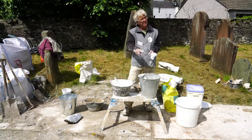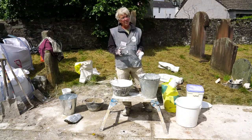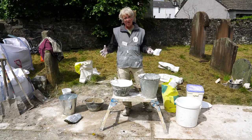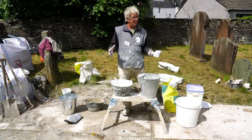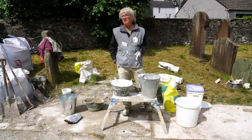It was only in a few places that it had failed. So lime wash is much more durable than people say. And if you think about a 15 or 20 year cycle, that's actually a longer cycle than most modern paints would achieve on that same building. And it will be doing your building good in the meantime, not bad, which most of the other modern things would be. Is that a reasonable period of time before recoating, or sooner?